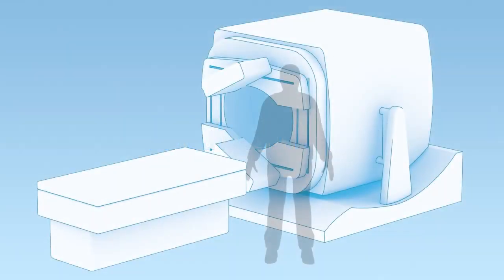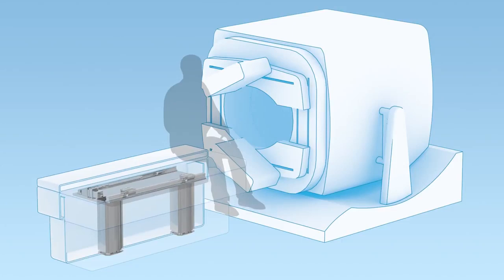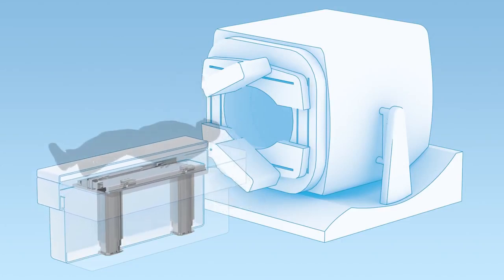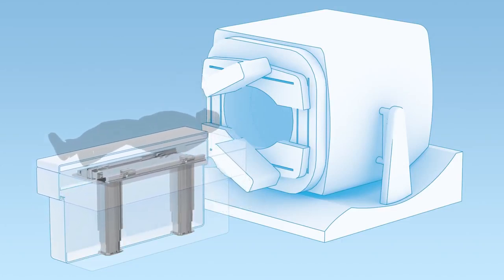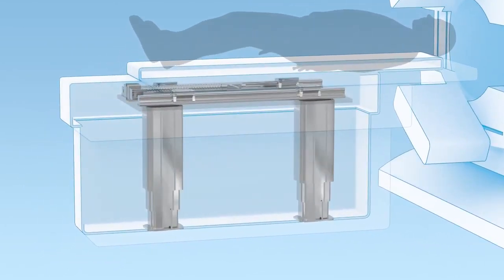So in terms of those medical applications, these lifting columns would be used in a patient bed, maybe an x-ray table, some kind of scanning mechanism, where you can use 2 units. The telescoping effect allows the bed to be lowered to a height level that's easy for the patient to get on the table. The lifting columns allow that to be raised so that the doctor can operate comfortably, or perhaps used to meet the level of the machine for that scanning mechanism.